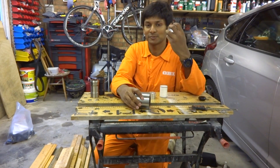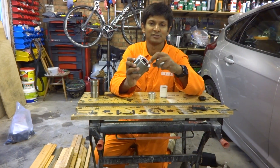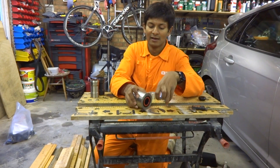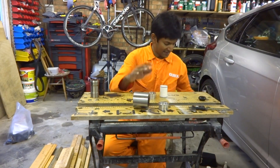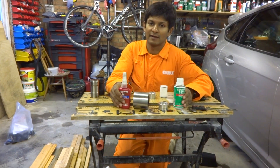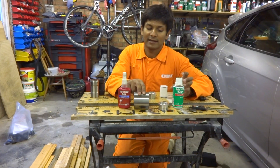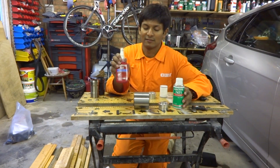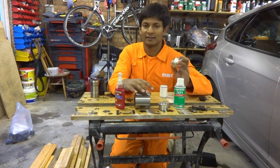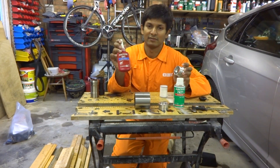The tolerance between the bearing and the cup — bear in mind this one is aluminium, but most manufacturers use plastic cups made in the injection moulding process, and the tolerance can be fairly slack. So you put the cup in, put the bearing in, and you might feel a bit of wobble or creak. To fix that, what you need is retaining compound and the secret ingredient, which is activator. The bearing material does not stick well to plastic, so you spray the activator on and then apply the retaining compound. The same goes for the cup going into the bottom bracket shell.